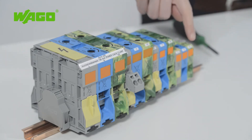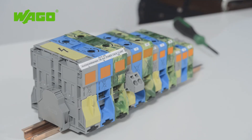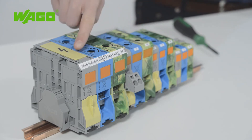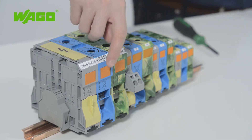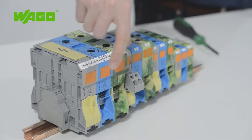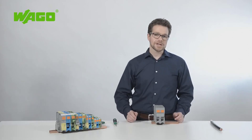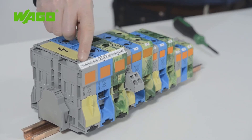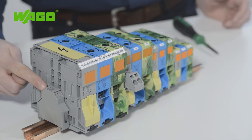The entire range of accessories from WAGO's other high current terminal block family is now also available for this line of 185 mm² terminal blocks, providing a high degree of functionality and safety. This includes power taps for supply and control cabinet outlets, up to warning covers that protect against accidental contact. The warning notices on blocks also provide additional safety, as do the finger guard covers for unused conductor entries. Clear labeling is a hallmark for this line, providing safe and easy-to-read markings in compact spaces.